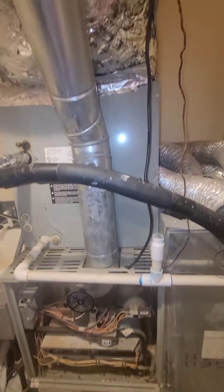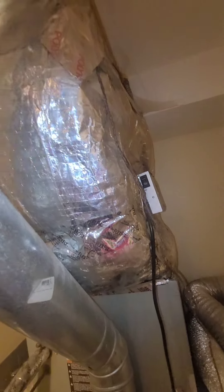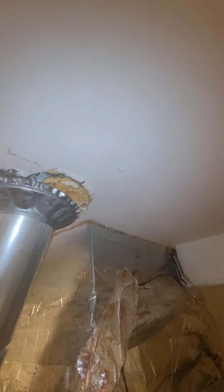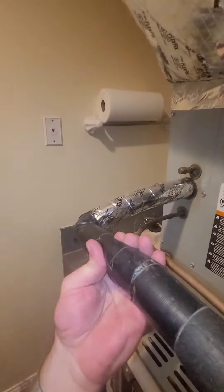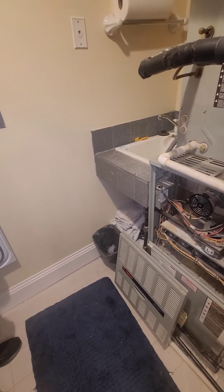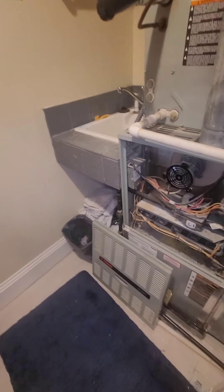Gentlemen, this is your furnace coil for the second floor — a 1984 4-ton furnace with a 4-ton coil. It has some kind of UV light, but it's turned off currently. All-metal ductwork coming right down the top of it and a metal return box off to one side. We're 21 inches wide and 64 inches tall. With Selkirk B-Vent that we need to be very careful with — I don't know how it's supported in the attic, but there might be an issue there. Line set is 3/8, and that feels like a 3/4 line set. Gas line's good, but it is a tight fit between it and this little sink. The gas line's got a coupling on it that's not supposed to be there — they used a protector coupling, not a true coupling.